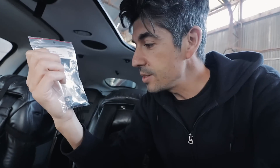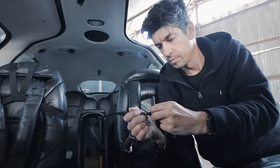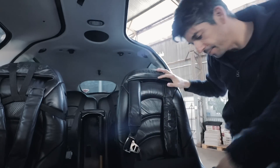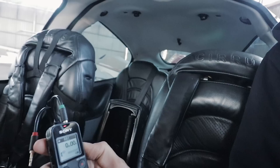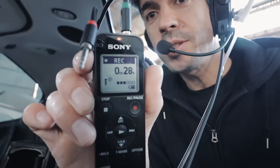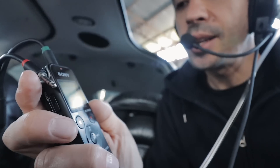The third thing I wanted to try is related to audio. I've got a line level adjuster which basically keeps the level of audio I get from air traffic control in my headset down so it's not clipping — so I'm not getting all that distortion on the line. I tried one which was pretty good, but there was still a little bit of clipping going on. The company iAvionics sent me another version, which apparently reduces the level even more and should give me a much cleaner signal. One's got a white tip, one's got a black tip. So put the new one in and let's test it — audio in, not mic in. One two three four, one two three four. It looks like it is helping to reduce the level based on what I can see on the level output — it's not going right up to the top. I won't know until I listen back, but let me know what you think.